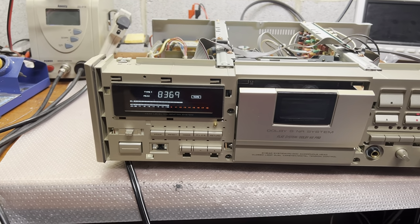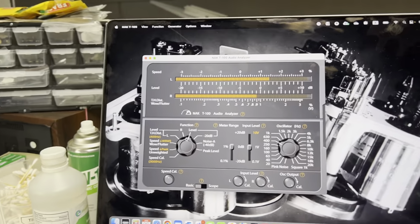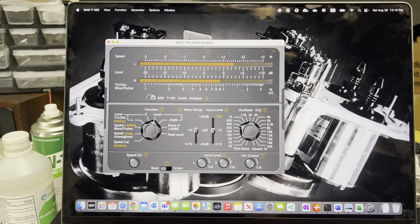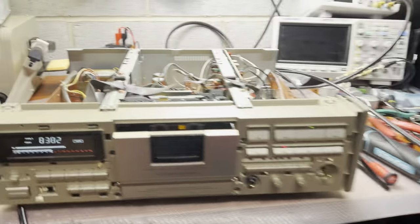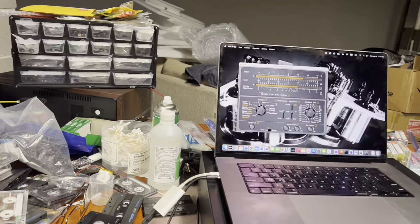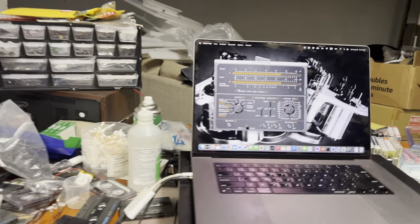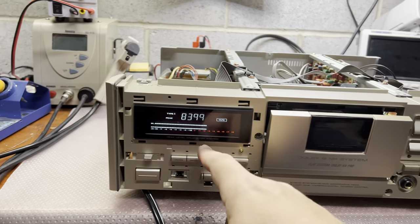And you see how it is balanced between the two channels, and the same picture we're observing here. So the right channel is off. They both should be plus 2 decibel. That is what I learned when I was working on my new CT42 deck. So the adjustment is here, right channel, increasing to plus 2. Good, even. And we have plus 2 here.